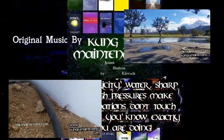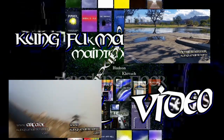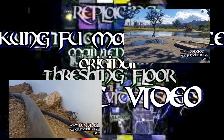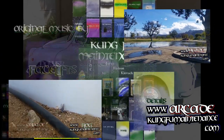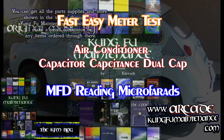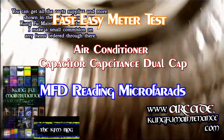Today I'm going to be showing you an easy way to check capacitance. What you need is a multimeter that can take microfarad readings. The Field Piece meter is one of them — definitely one of my favorite meters, in that you can also use a K-type clamp to check temperature, which is useful for measuring superheat and subcool. So definitely really cool for HVAC techs.